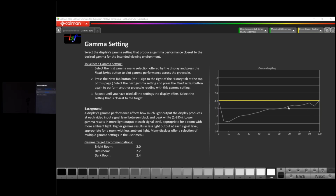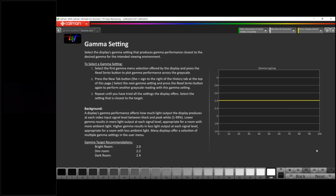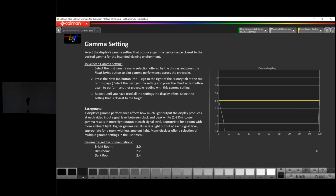75 starts to get a little lower than the rest on the top end. So if you look at 75 versus 90, for example, there's a pretty big discrepancy there if you zoom in. So for 75, let's go -7 clicks. And then 70 will do the same, -7. Now, if this works, the hope is from 70 and up, we have a nice flat line. We'll see. And if that works, I'll continue down and try to flatten everything out. If it doesn't work, we're kind of stuck here with a bad control.